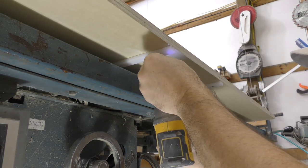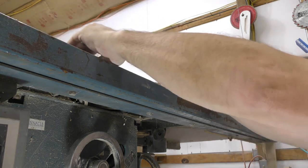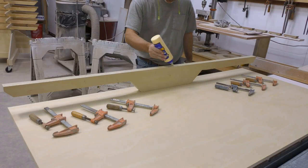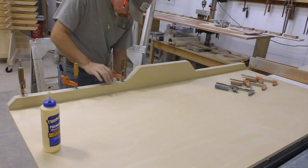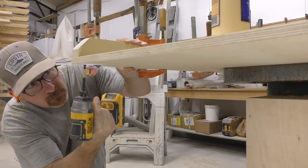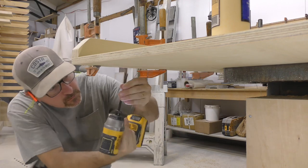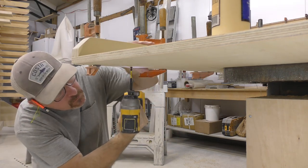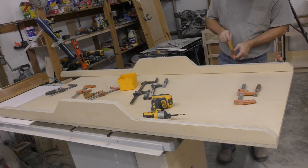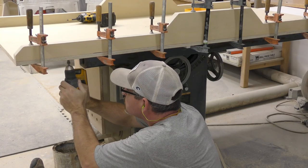I'll move the fence out of the way and slide the deck back so we can insert the three-quarter-inch screws from the underside — half of the screws from the front and the other half from the back. Next we can glue and clamp our six-foot back fence to our sled deck, keeping the back edge of the fence and the back edge of the deck flush. We'll pre-drill and use two-inch screws to secure the fence. On the front side we'll do the same minus the glue, and I'll check the fence with a straight edge and make any adjustments before screwing it into place.